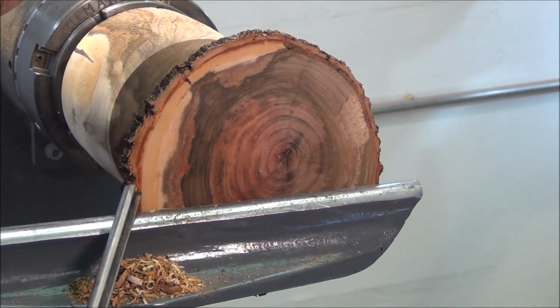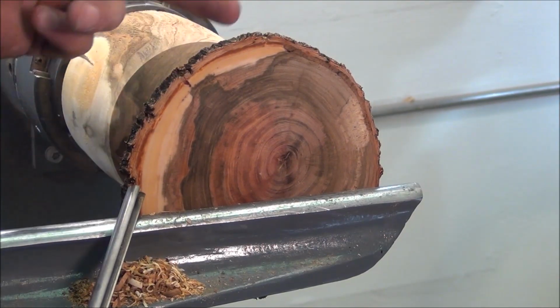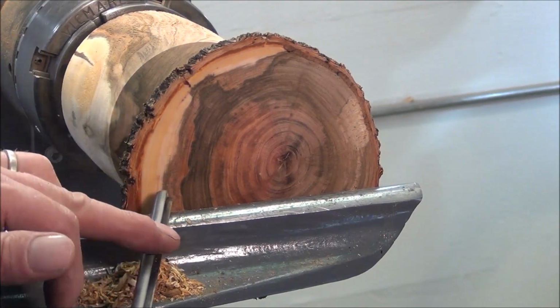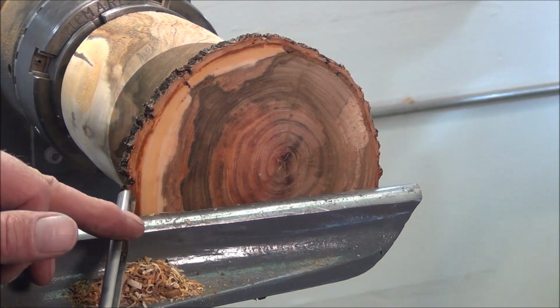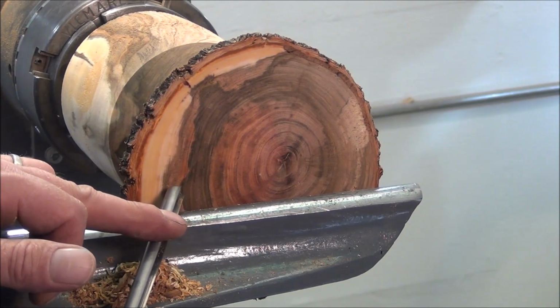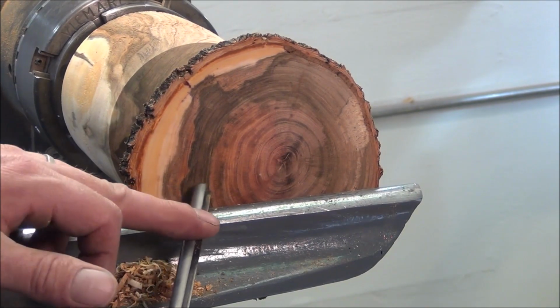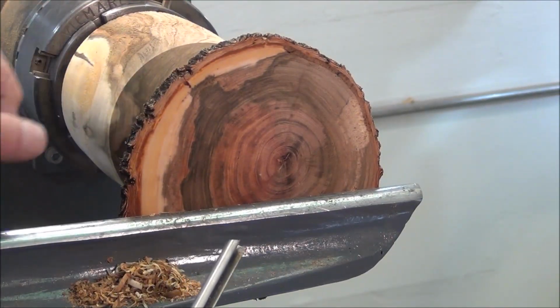It would have to be a non-natural edged vase. The natural edge looks nice on this. So, if we make a cut here, we can work back and make this the thickness we want, because you've cleared the wood in front of the next cut. And then so on and so forth, and we take this down a step at a time on the outside.